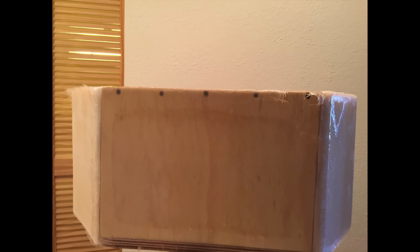I laid it on fairly heavy - I think I've got a total of four or five layers of glass on top. Slowly built it up, reinforced the corners with double layers. You can see in the center there I put an extra three more layers than what encompasses the rest, so I have strength there for the mounting. Then on the top where I plan on putting the handle, I've got numerous layers on there as well to help with the reinforcing.